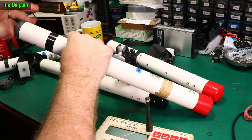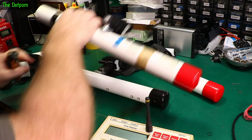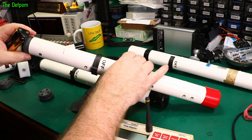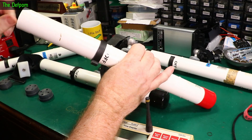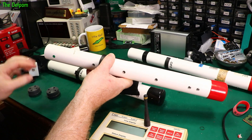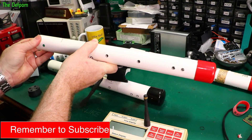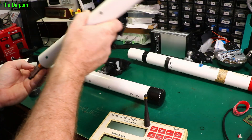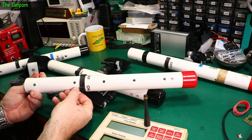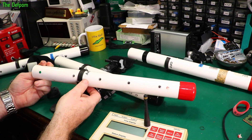The next thing I'm going to do is check the other red pole, because it looks like this black pole is faulty — at least so far. Let's change to the other red pole and verify it actually works, because it could be more than one fault — that's quite a common thing. This one seems to be completely dead. Now it's on — so this has got a dodgy reed switch. Like I was thinking, more than one fault. Maybe it's just stuck; it just needed movement after sitting unused.